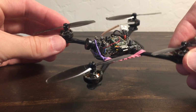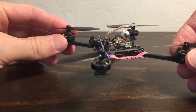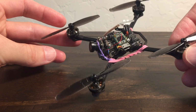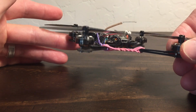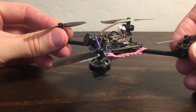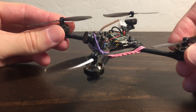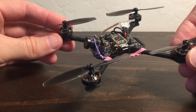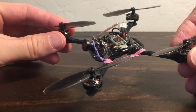The main reason is partially the efficiency, but I think it's actually the smoothness. I've been getting really nice results with JESC 48 kilohertz, and I like the way it flies better. As a bonus, I've been picking up probably 30, 40 seconds of flight time, which is a nice little bonus. So for 1102s with real lightweight 65 millimeter props, easy to spin, use it. I don't see much downside. You don't have to retune it. It doesn't feel mushy. It just works.